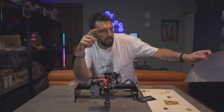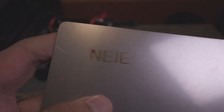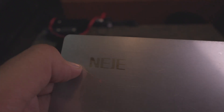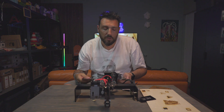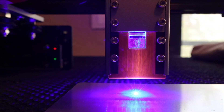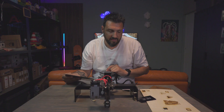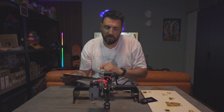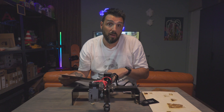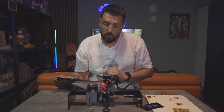Before getting to the leather, which really impressed me, I wanted to show you how it performed on stainless steel. By the closeup, this piece of stainless steel is not perfectly flat — it went through a lot of bumps, so power was not constant when it was engraving. Nonetheless, it started engraving stainless steel at 300 speed at 100% power — full power at 300 millimeters per second — which was really good.